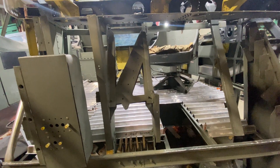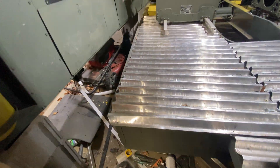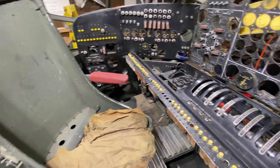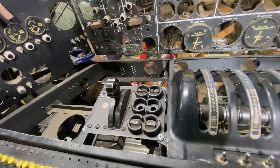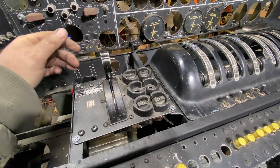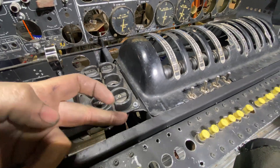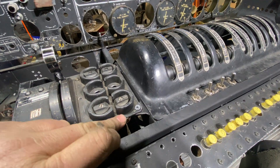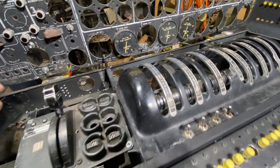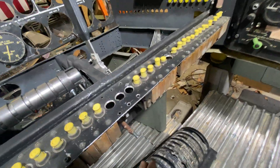I have done a lot up here. I guess it would be easier to start up there so it all makes sense. The first thing I did was realize that the turbo supercharger control here was not properly oriented — it was about half an inch too close. It needs to be seven-eighths of an inch from this point to this point here, so I moved it back. I'll spoil the show here but we've got to start where we start.